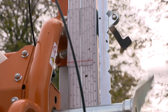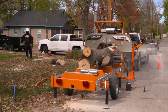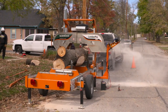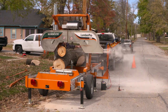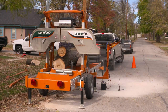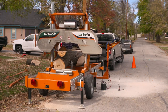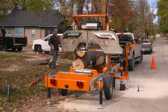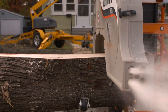This little odd-shaped piece I'm going to live edge cut, because it's an interesting shape and I wouldn't get real good boards out of it. So this first cut is going to be a light cut to remove some of those high spots, get me down to good solid wood, and get rid of some of that bark — and this will just get discarded. One of the great things about sawing with my tree guys here is that they can a lot of times take this stuff away and chip it, so I don't have to worry about disposal. Then after the bark's gone, I can start really making some good live edge boards, cutting these at two inches, which is kind of my standard for live edge stuff.